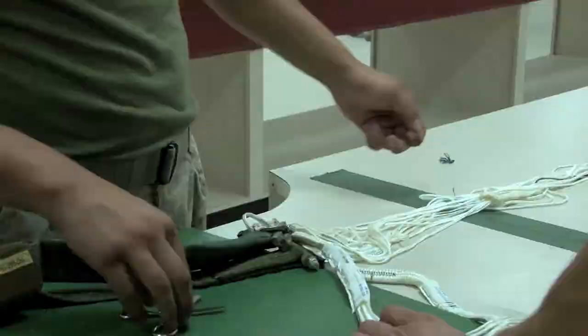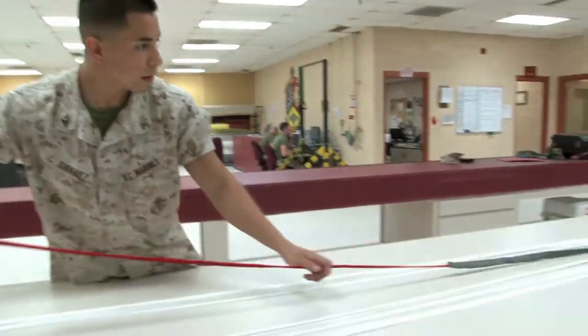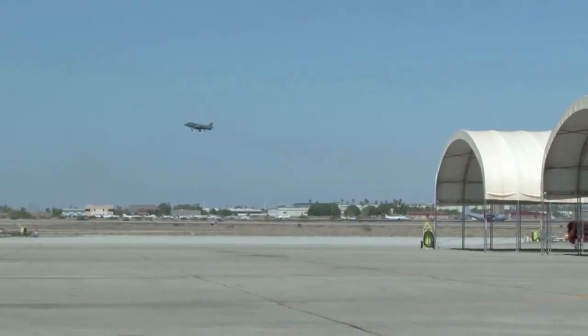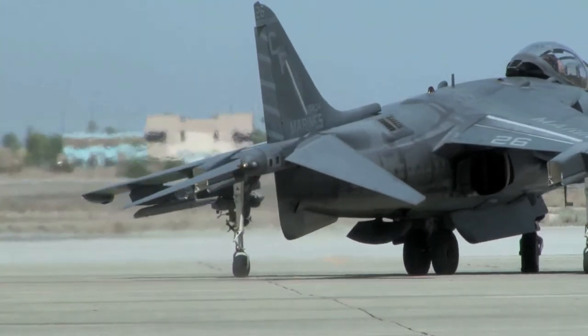We have several items that have expiration dates. Sometimes we have to replace them, such as the risers or the spreader gun. The spreader gun has a cartridge-actuated device in it. When it gets pulled, it'll cause a little explosion, which will make the parachute open. Because the Harriers often fly at low altitude, this device is necessary to open the parachute canopy.